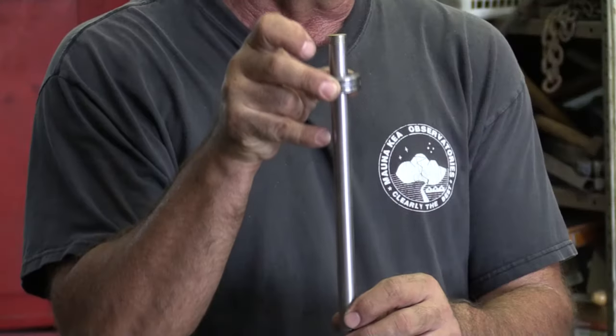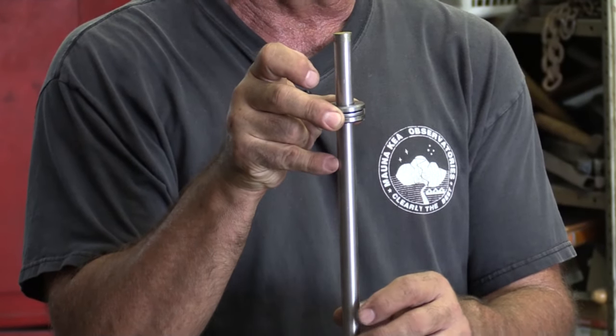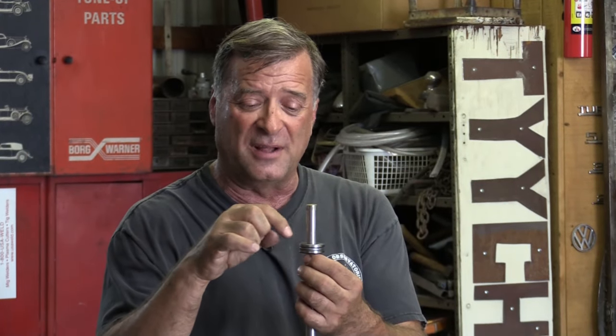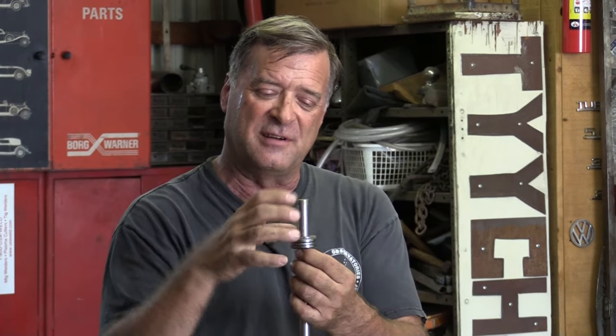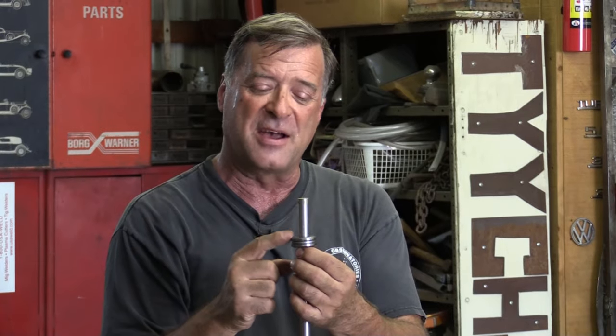What that allowed me to do was: now I only need one bearing on the top of the whole pedestal for Roundabout. The bearing went down over a shaft that was welded to the sculpture itself. On the bottom of the sculpture, I welded another big washer — something big, heavy, and flat — cut out of a piece of plate with a hole saw and welded right to the bottom of my sculpture. Now my upper race has something to butt up against, and I did the same thing on the pedestal side.